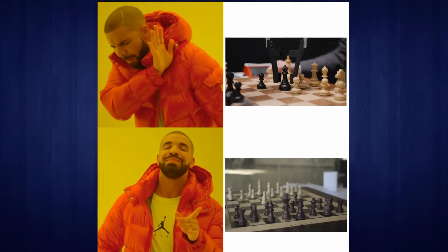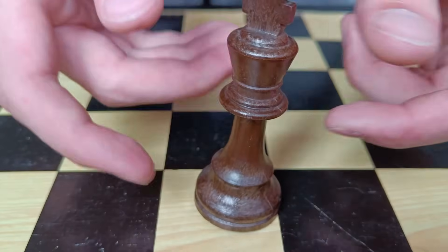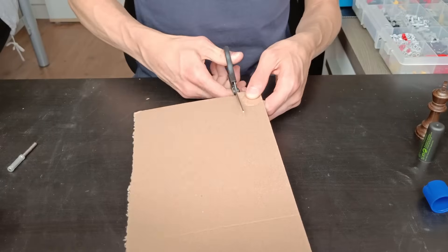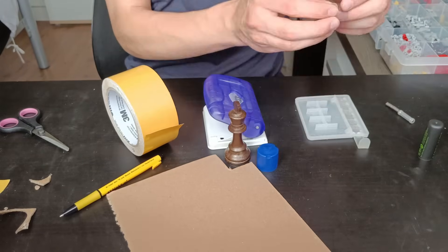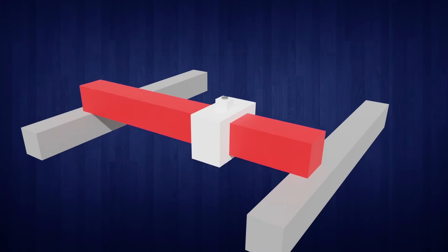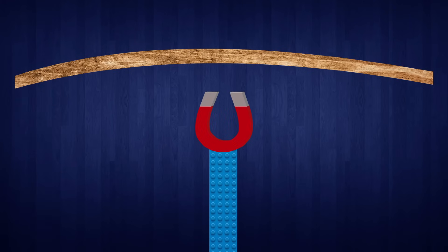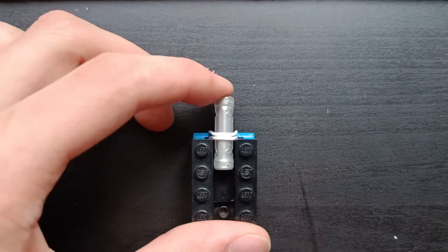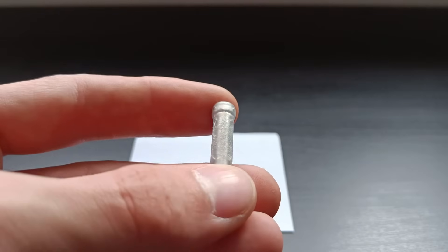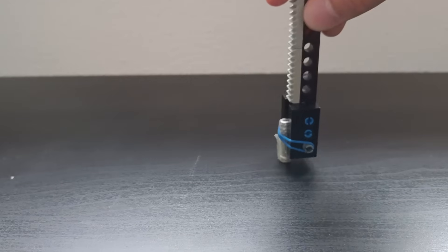This gives us the magical movement instead of having to use a chunky robot arm. Now the problem with using a tiny magnet is that the pieces are unstable, plus the magnet isn't fixed in place and can come loose. To fix this, I cut circles out of cardboard to attach to the pieces — in the middle there's a hole for the magnet, and the cardboard stabilizes the piece. Unfortunately, the board isn't completely straight. Because of this, we can't simply slap the magnet onto a stiff mechanism, because the machine will break itself trying to move up, or not even get there at all. I want to use rubber bands, but they would just slide up the magnet. So I glued a hook onto the magnet with hot glue to stop the sliding. Now it stops the rubber band from sliding up the magnet, and we have a way to compensate for the bent board.